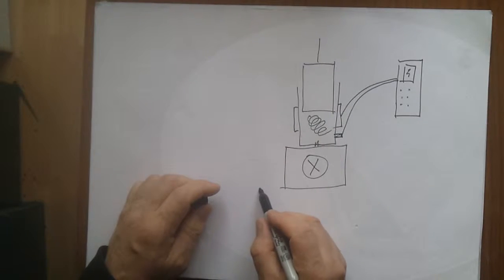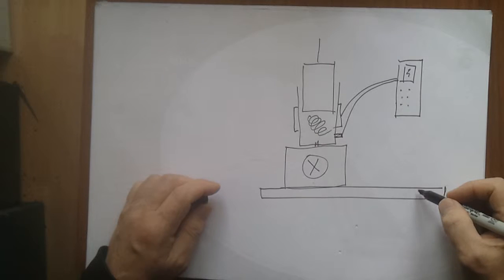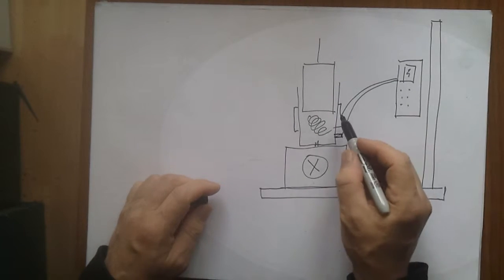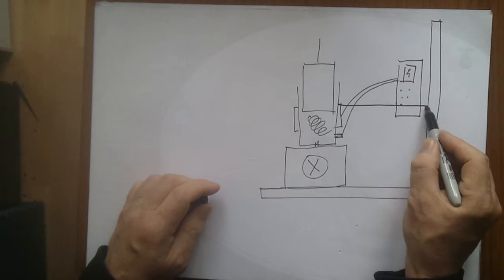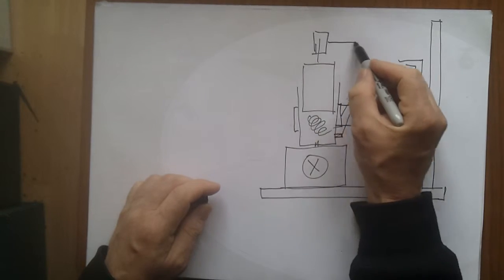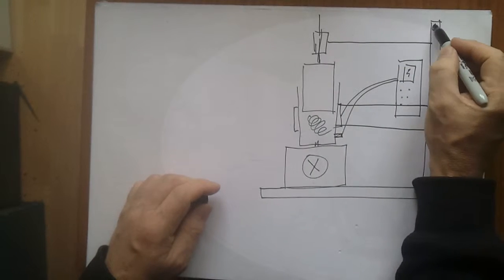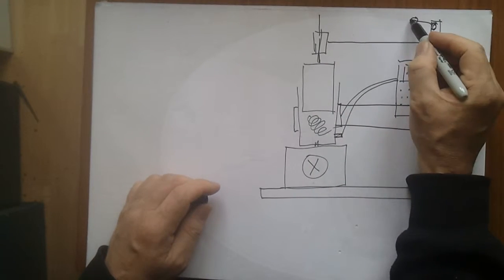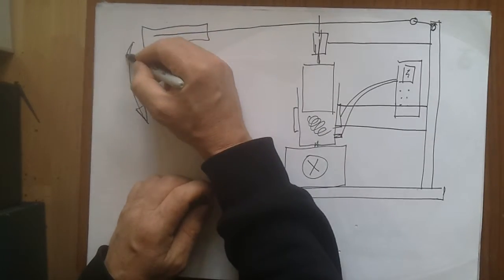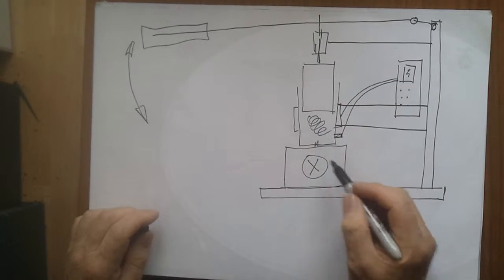In order for this to work you also need a support structure around the whole thing. So you'll need a base plate, some kind of a riser, support for the injector, a linear bearing for the plunger to go through, and some kind of a linkage system and a handle which you pull down in order to make the plunger go down and extrude the plastic.